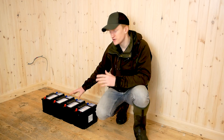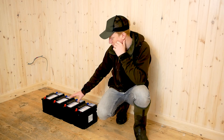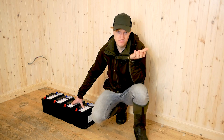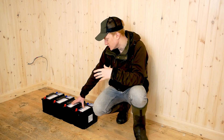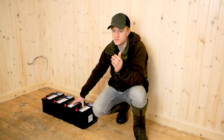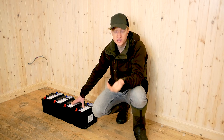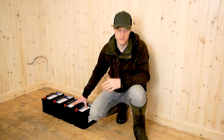If you discharge them more than 50%, you end up actually damaging your cells, so it's not good to do that. We had 60Ah of actual usable storage rather than 120, and what was happening was it was just being discharged too much - beyond 50% quite regularly, which was going to damage the batteries. So we needed more batteries. When you're building an off-grid system, it's better to have more batteries so that you can discharge them to 50% but still have enough power.